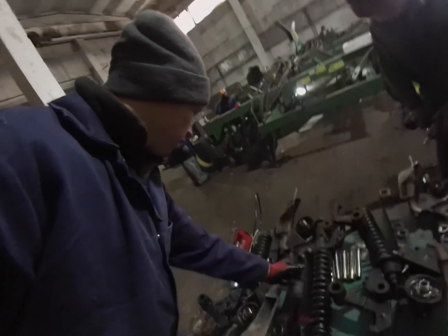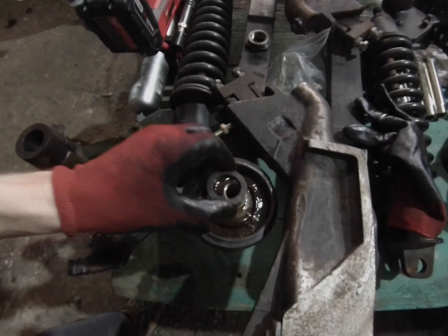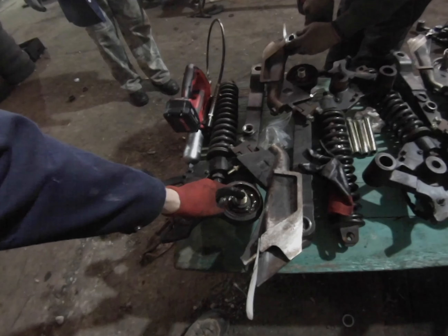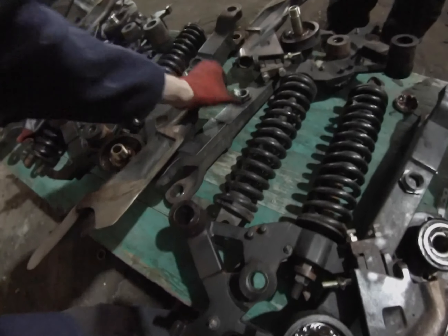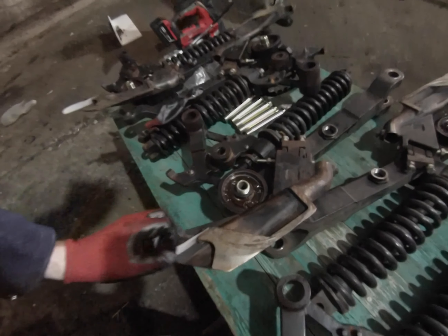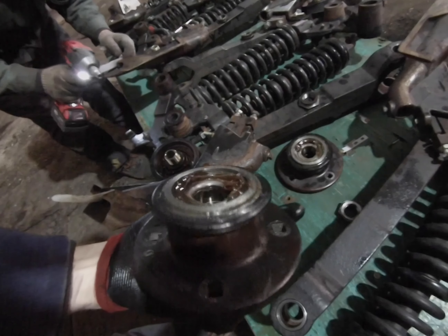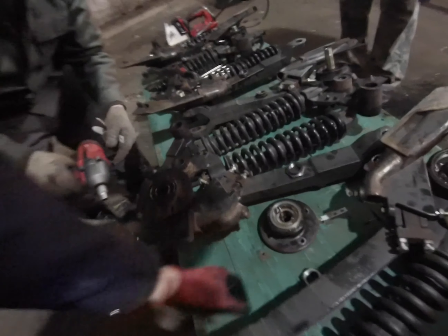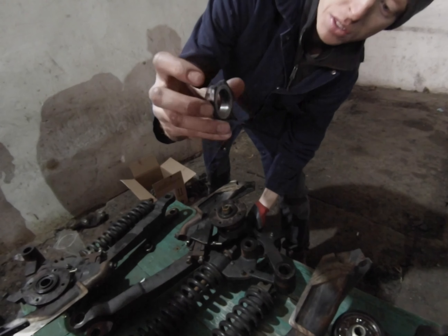We'll start putting these hubs on simultaneously as we get help. You put the washer on first, then we've filled the cavity full of grease and drop on the spacer. Once the hub goes on, the nut goes on. There is a right and a left hand threaded spindle, so you want to make sure you get the correct spindle. We inspected these seals and for the most part they're looking okay, but some are not the best - we had only three replacements for the whole drill. The right hand spindle nut has no little notch; there's a groove on the left hand ones. These are directional.